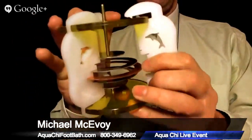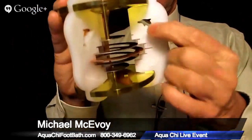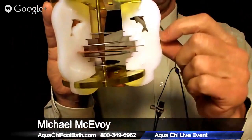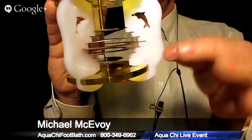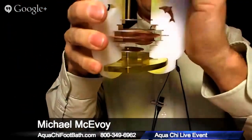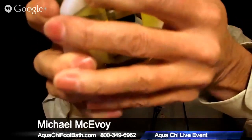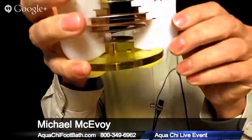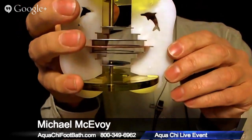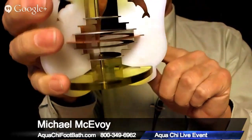You're going to line it up with both sides. Make sure you put the dolphin facing up the same way as the others, because you could put it upside down if you're not looking. And then line up the rings. First the copper ring. Let's make sure we get this lined up here. Okay, good. Now you can see that I've already begun to get it back in. The copper ring's already in its slot, and these other rings look like they're lining up pretty nicely.